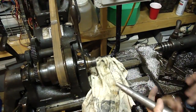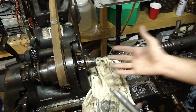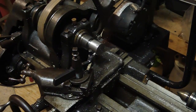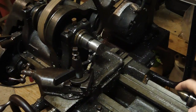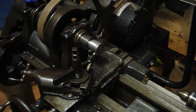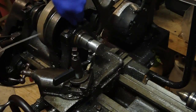So a new addition, a new part. I've just got to clean up all of this grit because it's everywhere, and I don't want it on my ways, I don't want it in my spindle, I don't want it anywhere near my lathe. But it was something that had to be done. Now for the cleanup procedure. I've set back up, lapped the center, it's driven into the headstock. Now I'm going to cut the taper for the dead center here. I've got my compound set at 30 degrees. I checked it against my live center with a straight edge - straight across this way and this angle, on this side and this angle line right up. It's close by eye. I guess I can print out a gauge to check it for 60 degrees later, but I don't have one right now. Oil it up real quick and then we'll start on these cuts. I have to get some more spindle lube consumables.